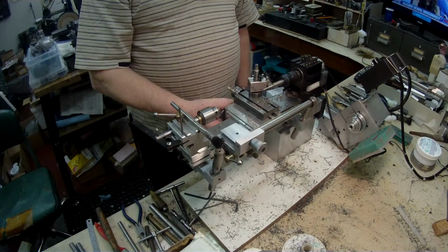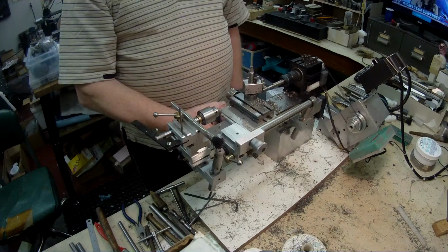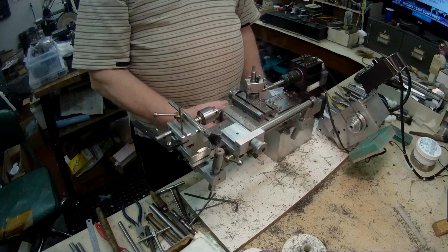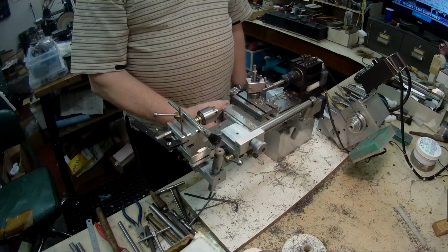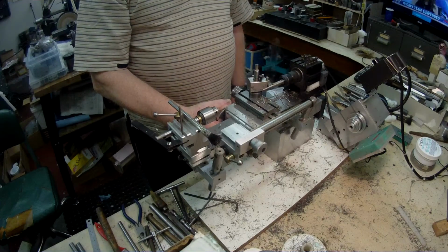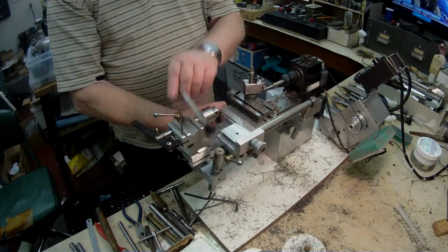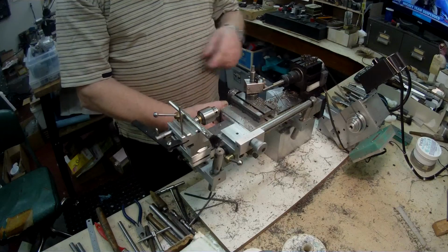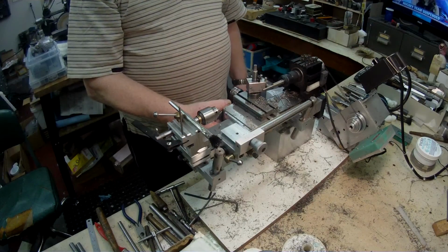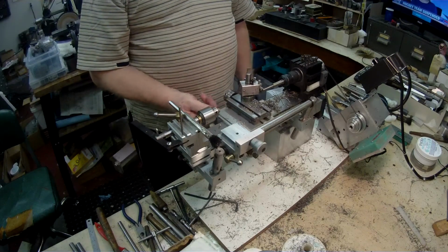I have lots of little tool bits that I've accumulated over the years, and some of them are very good brands. I bought some Chinese stuff that seems to work okay. I think sometimes we're all influenced by industry and the retailers that tell us that we have to have carbides. There's no alternative. If I put a carbide in here and took a big cut, this motor would just stop anyway. You need lots of power for carbide. So I think it's six of one and half a dozen of the other, personally. Nothing wrong with that. There you go.